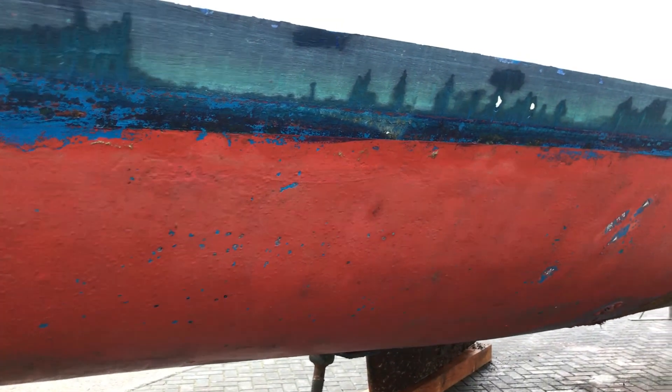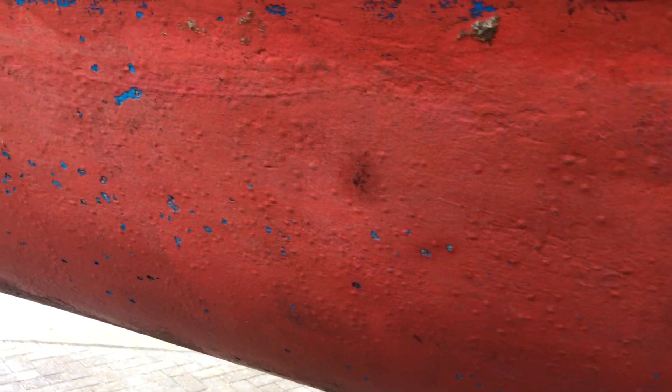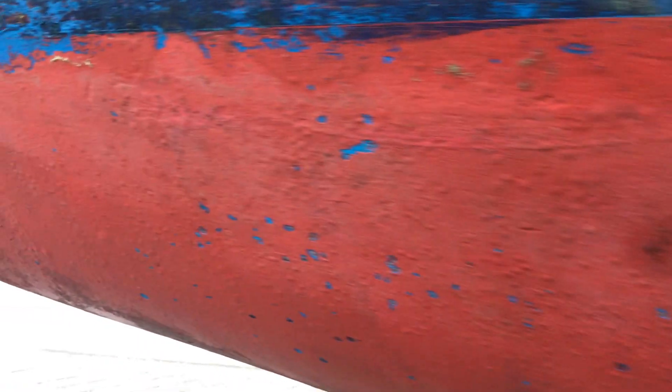So underneath this boat, this is a 1980s Westerly Forma 32 with osmosis. Oh no, we all cry. So let's see — how can you tell if a boat has osmosis? You see all these little bumps here? These are all osmotic blisters. It means the boat has a bit of osmosis, and quite often you'll find them in groups in areas around the boat, or if you're unfortunate, larger areas or the whole underside, or if you're more fortunate, there might be just isolated groups like that.